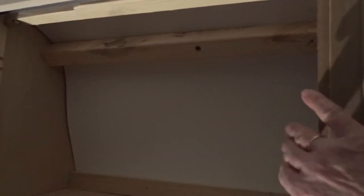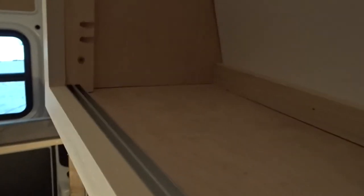These are my mock-up cardboard doors because they're going to be sliders. I found this really good plastic coat wall panel from Lowe's — it was a 4x8 foot sheet that cuts really easily. We'll be painting these white so it looks nicer, and then painting the cabinets. I used a quarter-inch aluminum track that the doors will slide in. I used Kreg screws to attach the frame — the frame is poplar — and to affix this piece so I could screw it into the side piece. Nothing is glued so I can take it all apart. Up top I left the tracks so I can lift them up to get the doors in, then push them back down so there's a slot that they sit in.